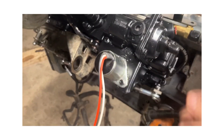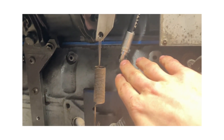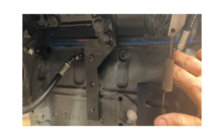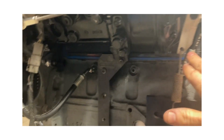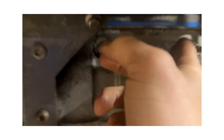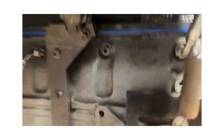The lubrication is completely different on that side, so I ran the line down here with a 90-degree fitting back to this oil port. You're going to want to go to a hydraulic shop. A good way to get your length right is to use a piece of solder, bend it around the routing path, and take that to the guy — he'll get you the right length. It's going into a 90 here with the same O-ring boss fitting in behind that, and then a JIC pipe fitting. That comes up to the passenger side here.